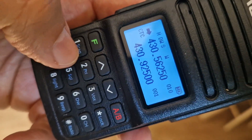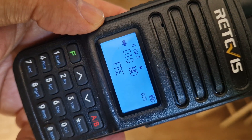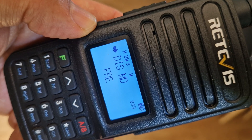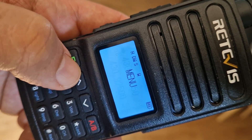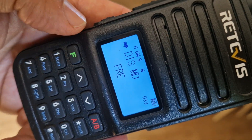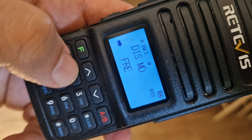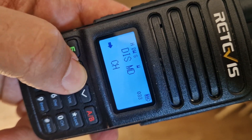There is a quick way of doing it — you can just go F33. If you've got the latest firmware it will do that. At the moment it says display memory mode is set to frequency. If we press F33 again there is a timeout, then we go F and can go up and down with the arrows, showing the channels.